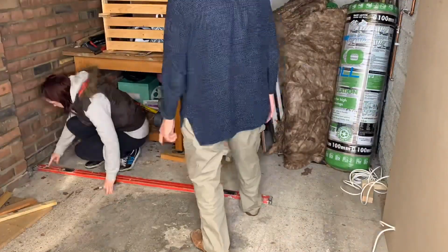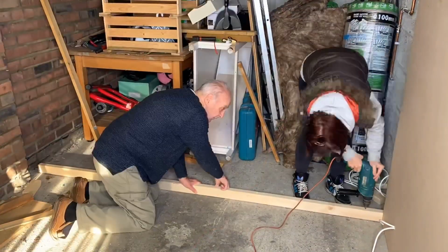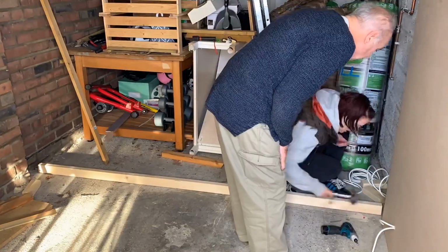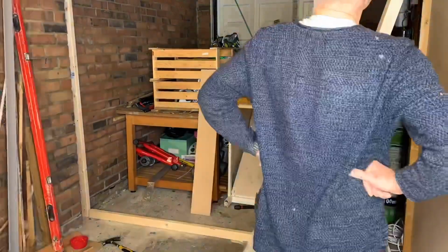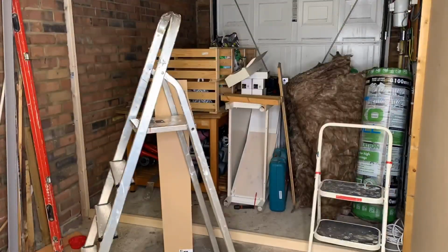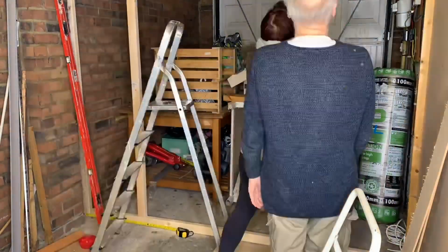For the partition wall, we screwed a batten into the floor, being sure that it was level first, because no one wants a wonky wall. Then we added uprights screwed at an angle to both the floor batten and the rafters. MDF board was added at a slightly later time and was put on top just like we had done before. Later on, we boarded the garage side and filled with insulation, just like we did on the other walls as well.